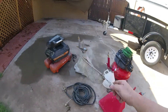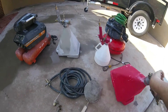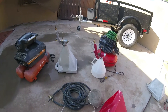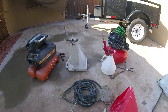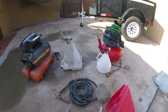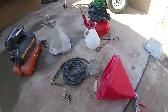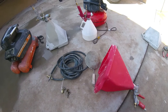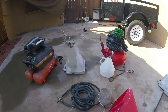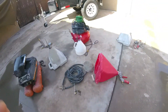You always want a strainer. This is a basic strainer — we use this to strain our muds. I strain my joint compound into the hopper. That takes all the boogers and goobers out of the mud. You have to do this with orange peels and with splatters. If your mud's kind of chunky and doesn't look like cream, you definitely have to strain it — old mud especially. Always strain your orange peels and splatters. You don't necessarily have to strain your knockdowns, but go ahead and strain it anyway — take the extra time. When you go to knockdown, if you get a goober in your texture and go to knock it down, it's going to scratch.